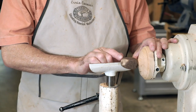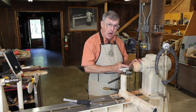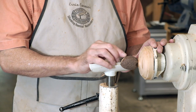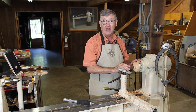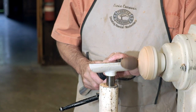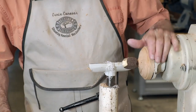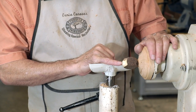We're going to do a little bit of turning on the outside, but we're mostly going to turn the inside of the little miniature vessel we're making here. Tagua nuts — about 95% of them will have a bit of a void in the middle, a fissure. A few do not have any at all, but most do. So we're going to go down in here, find the fissure, turn that away, get something that has a nice shape, and then turn the outside to match that shape. You can turn tagua with spindle turning tools — they have to be very sharp. It loves scraping, so most of the final work will be done with scrapers. And there we can see the attachment point leads into a fissure, so now we'll start hollowing it out.